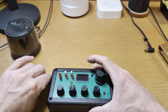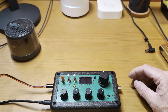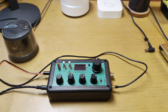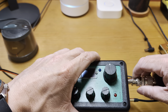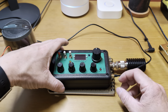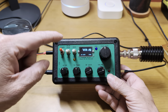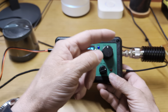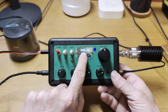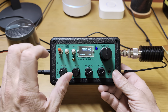Let's turn the radio on and talk about features, likes, and dislikes. You can hear immediately my phone causing interference — that's a common problem with these little CW-only radios. The KX1 and Mountaintoppers are horrible with that too; it's just the nature of some of these little QRP radios. Right now we're on CW wide at 7.030. You can hear the noise in the background. If I change my receiver mode to narrow, that's going to shut it up considerably.